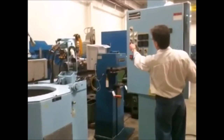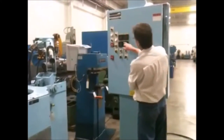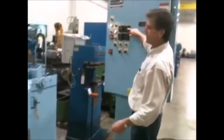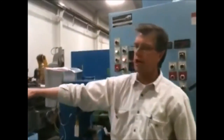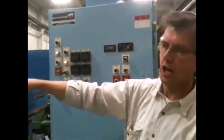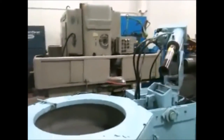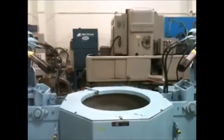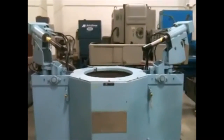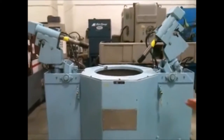All we do is flip them over. All four timers are set for 7 tenths of a second — 7 tenths forward rotation on the spindle, 7 tenths reverse rotation on the spindle, then they'll pull out and torque themselves. So in auto mode we hit cycle start: 2, 1, and they'll follow each other in now.